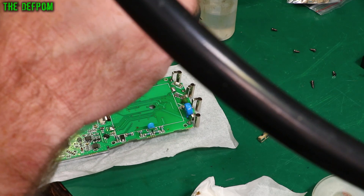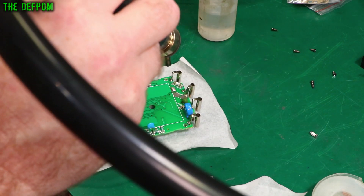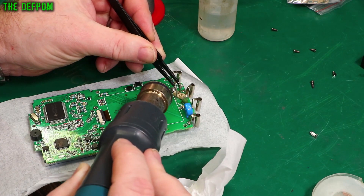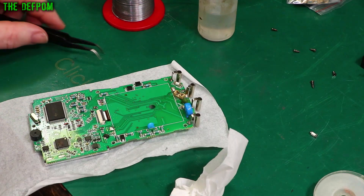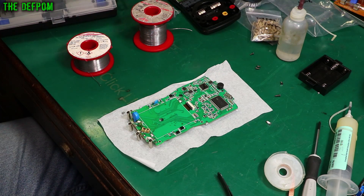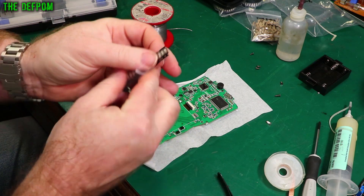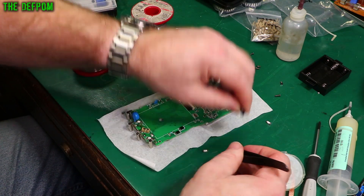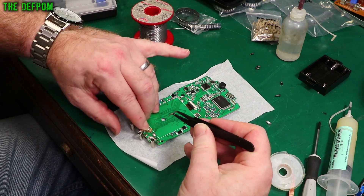I'm just trying to warm it up now — it's got a 250 rating. I'm going to get it warm before I put the piece down. The solder paste is all spreading out. Let's put this down. Let's see if that's stuck — hopefully it has. All right, so that's the fuse holder installed. Let's get a fuse. I need a 500mA, which I've got here — 0.5A. I'll pop that in.